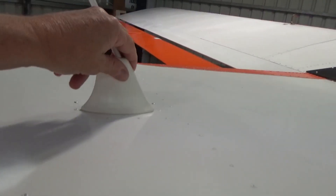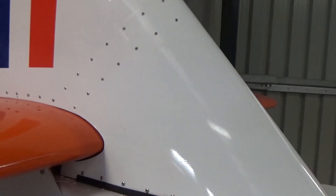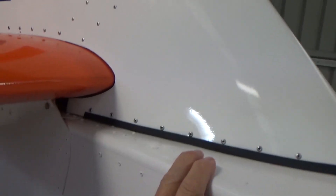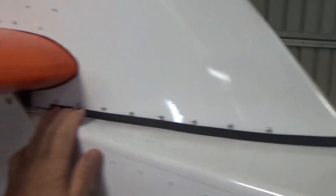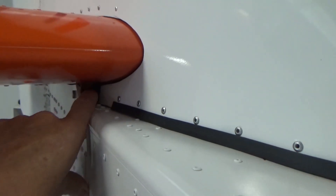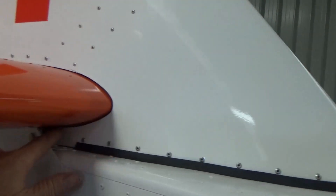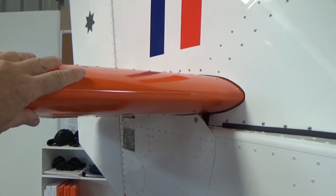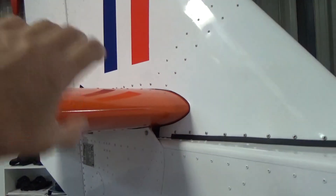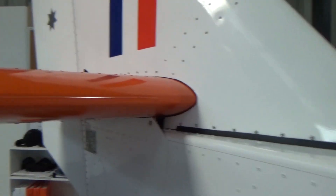The aerial modification I did has worked out well. The dorsal fin — two rows of rivets — rubber's still holding in there nicely, just filled that gap. I think it looks pretty good, a little professional and finished off, with no gap under there. Because you had to shorten the legs on the stab while keeping all your edge distances — we went through that. I got this nice and neat by making cardboard templates, but that involved removing the tail plane several times. Fit the tail plane without the fin, make a cardboard template, pull it all apart, fit the fin without the tail plane, put the cardboard template back on and get a nice result.